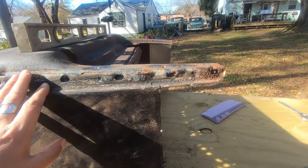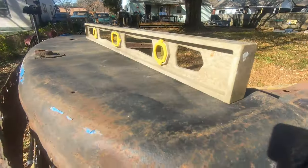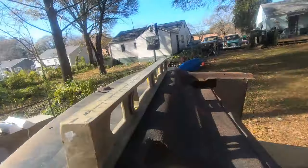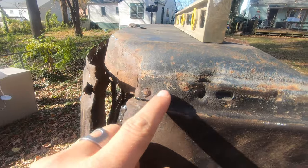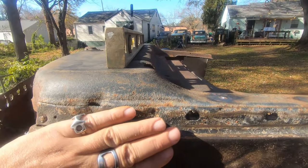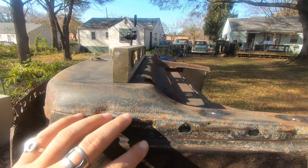Observations continue. Not only is this guy not in line with the guy over there, we still have sort of this concave shape. If I come over here you can see it better. That's probably not how it should be with that light coming in under the level. Clearly we have dents here that we've reviewed, but also this. So it appears that this rivet's stretched. Something's not right here.